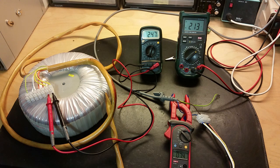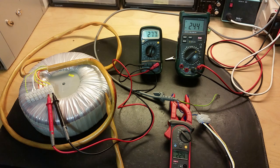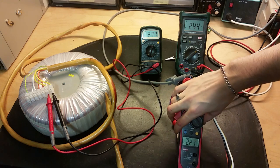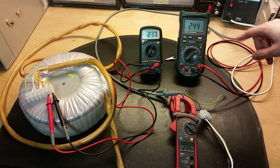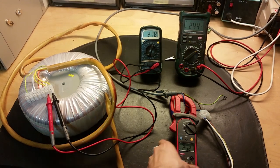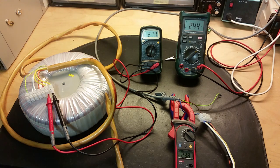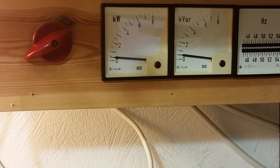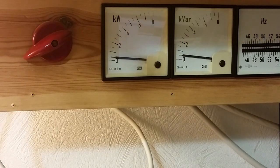Let's crank up the voltage a bit till we hear the hum from the transformer. Like that. As you can see, that's not so many volts that I raised it up, but we got 2.2 amps going into it now. I raised the voltage up like 32 to 40 volts, and that wasn't so many volts I raised it up, but the current rose up pretty dramatically. Output voltage is 278 volts. Now we can see we got a little bit more active power, and the reactive power just raised up to around 500 volt-amps.